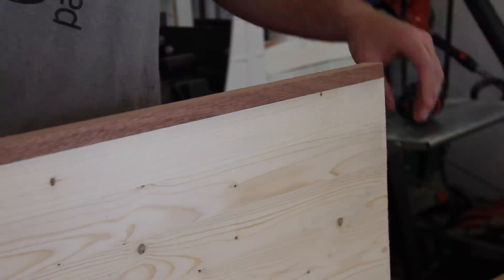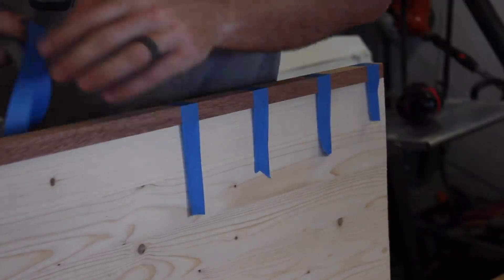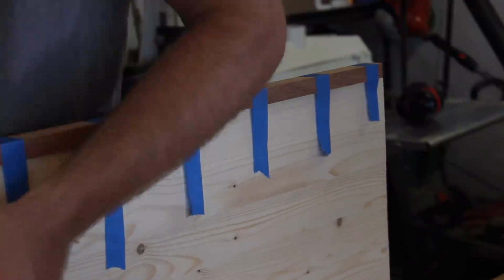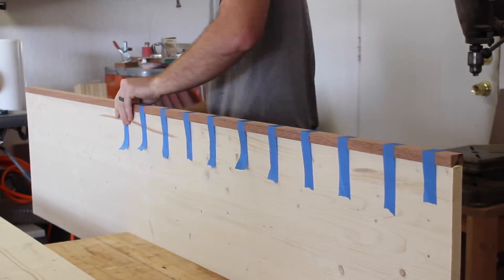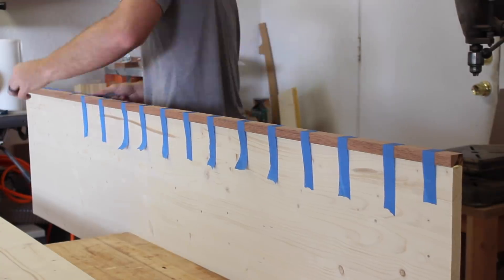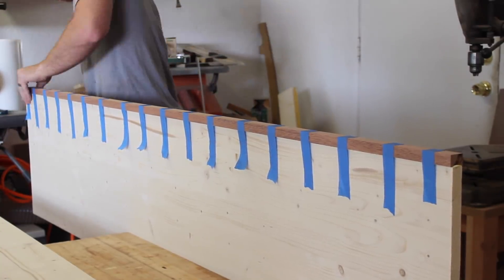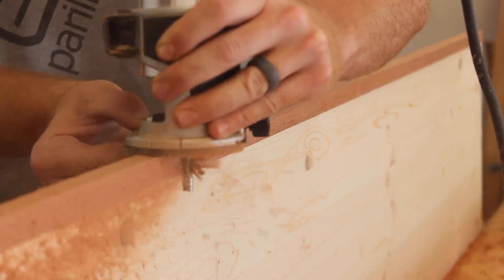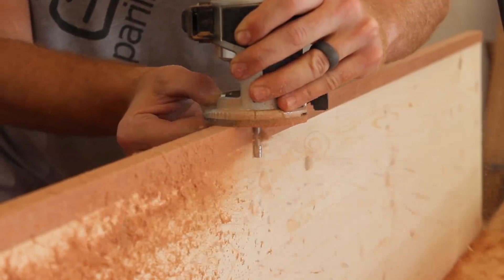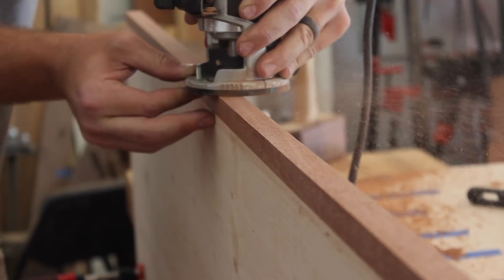These pre-laminated spruce panels are pretty handy. They save time, money, and they're also much lighter than their hardwood counterparts. I'm just using some blue tape to attach this mahogany edge banding, which is about three quarters of an inch thick. I left it slightly wider than the panels and I'll come back with a flush trim bit to get everything flushed up. There's not much surface area for the router to ride on, so I use my off hand to act as a makeshift edge guide so that the router doesn't tip.